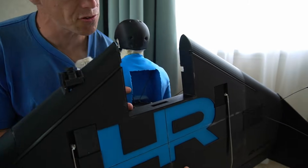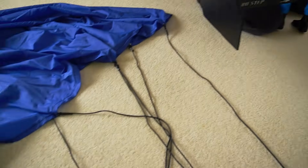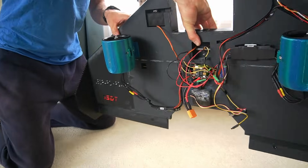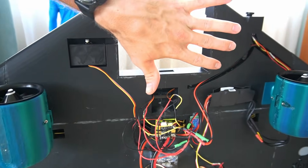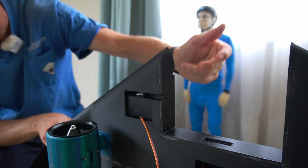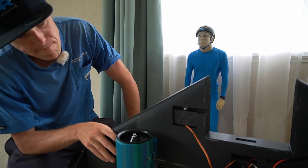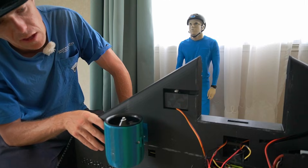It's time to make the capsule on the back — the parachute capsule. We're going to focus on the capsule itself. It's made in fabric — we're going to use ripstop material, just like we use on that parachute there. It's been highly tested in a previous episode. This is the release mechanism — there's the release servo. We'll need some kind of cable that comes around the parachute and then releases. It's very similar to what we did with the Mark II wingsuit design — we're going to use that for inspiration.